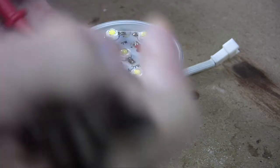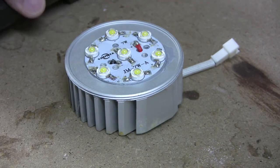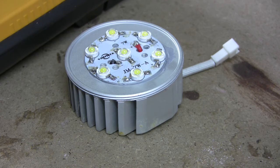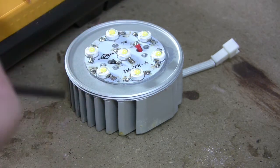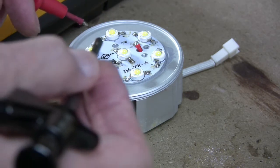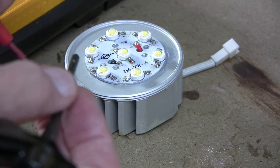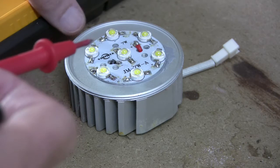I've got this on continuity, which makes the usual noise, but because of that it also has a voltage applied to the terminals of the test meter. If I go across the diode there should be enough voltage to actually light the diode slightly, to tell which one is faulty — so we don't actually need the test meter in view.